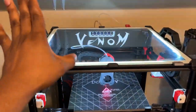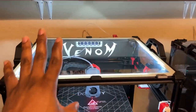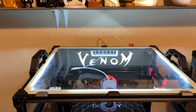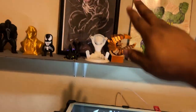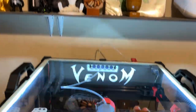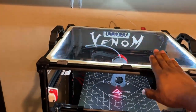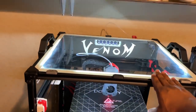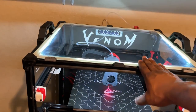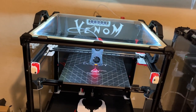The only downside with cheaper glass — not tempered glass — is that I'm using the kind you'd use for a mirror or picture frame, but this is a little bit thicker at 3mm. That type of glass is usually about 2mm, very thin, but this is a bit thicker. Either way, they're cheap, easy to cut to size, easy to clean, very rigid, keeps the heat in, and they add weight to your printer. Once you add these glass panels, your printer is more rigid.